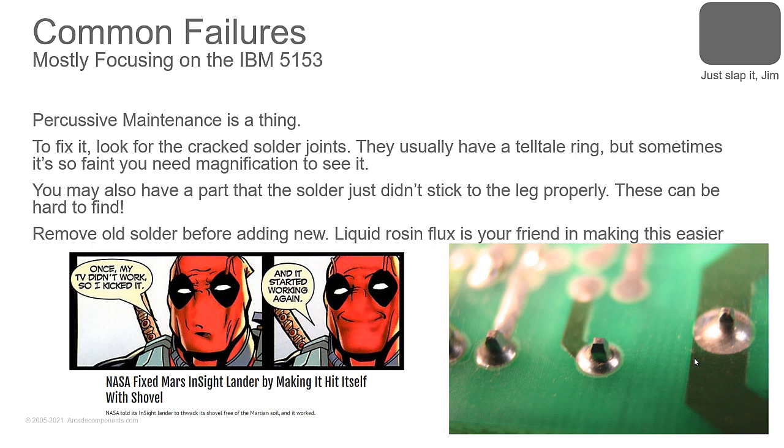Sometimes you'll find when the solder gets cracked and cooked because of heat, the electro arcing and stuff, and you see it looks black in there, you might need to add a little dab of rosin flux. GC Chemicals also makes a little bottle of rosin flux with a little brush applicator. You just dab a small amount, enough to just wet it with a little bit of rosin, and you'll hit it with the soldering iron, a little fresh solder, and boom, it'll flow beautifully. And then you can remove that old solder off and put all fresh on it.